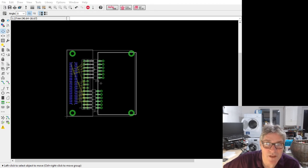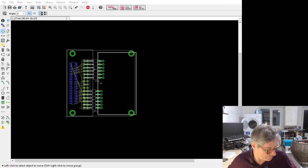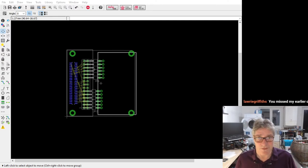Yeah, a super tile is a single entity. So if you're using the super tile slot to put the Mixmod adapter on, you wouldn't be able to add your normal super tile. It's just there really for backwards compatibility, to enable you to use stuff that you may already have on PMODs. I mean, mechanically it doesn't make much sense when you're deploying something in a robot anyhow, because it's not very mechanically sound.